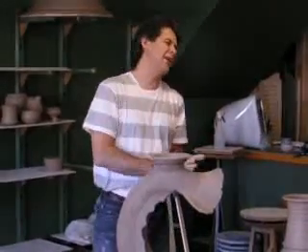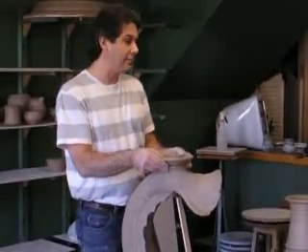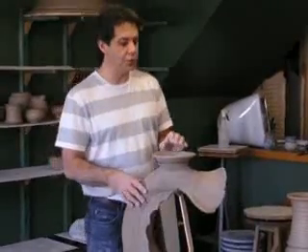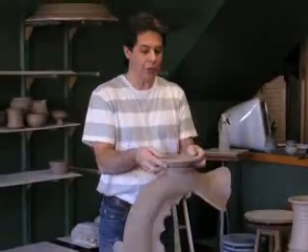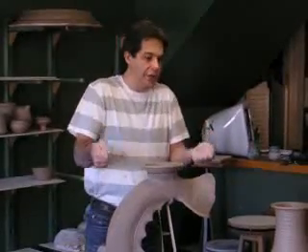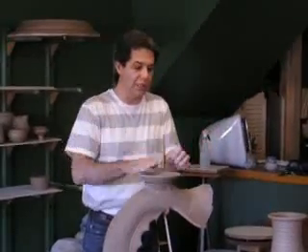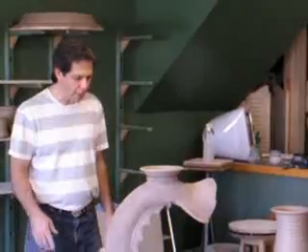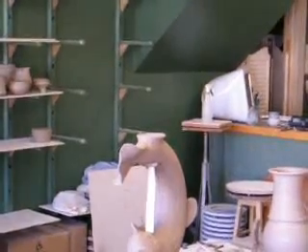Make it sturdy. Another thing that's really advantageous is to put a hole in here that goes into the base, because when you put the silicone on and the bath goes on, it creates a bit of pressure and doesn't really go all the way down. The hole in there allows it to press right down. The alternative is to leave a spot with no silicone, push it down with a tool, and twist it — but I like to put a hole in there. This has had a chance to stiffen a bit, and I've got all of those score lines in there.